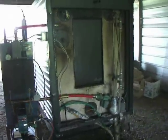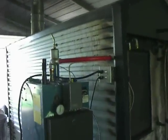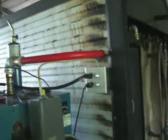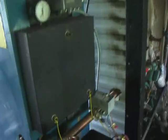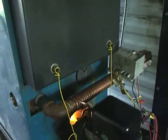I got a Taco pump wired in that circulates water between the two. I brought electricity over to have a switch for the Taco pump and a switch to turn the boiler on and off, plus a couple of plug-ins — one for the air compressor and one for the oil pump to bring oil up to the gun. I got a set of copper tubes, a small tube wrapped around the bigger tube to heat the oil as it comes up to the gun.